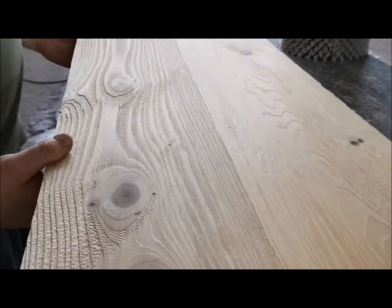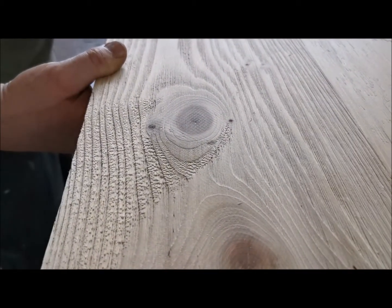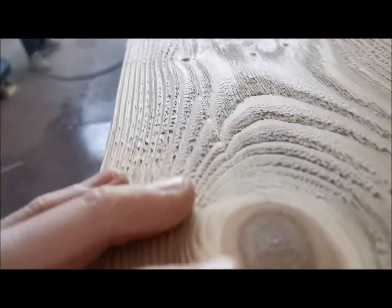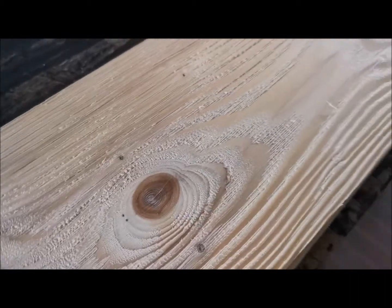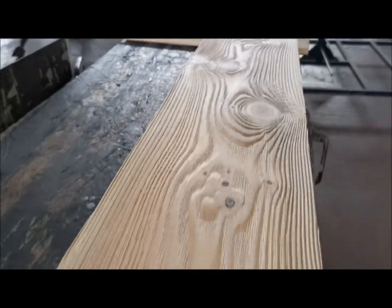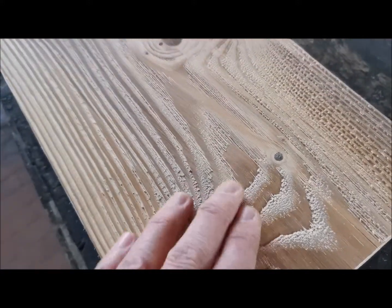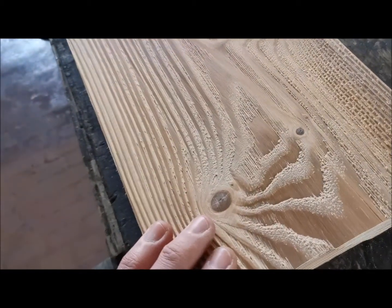You can see the difference between the first combination of steel, Tynex, Tynex, and steel, steel, Tynex. In my personal opinion, on soft wood, this is the best combination. As you can see, we are giving a deep effect of wire brushing on the grain, also 3-4 millimeters, and you have the sensation of a very destructured wood, almost old, aged, with an oxidizing effect, with some specific professional effect of stains and aging product or active stain. You can make this board become like an aged, reclaimed flooring.